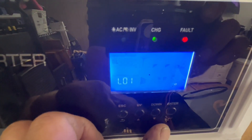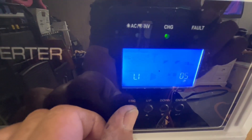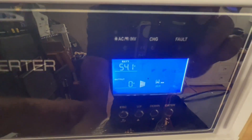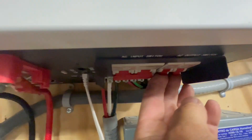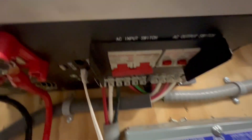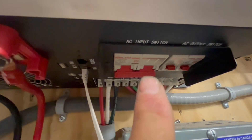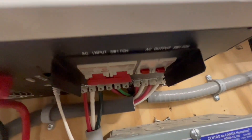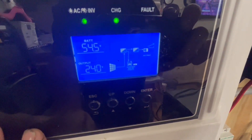It hits fault — give it a second, and it's gone. Now if we hit the Escape button over here, we get back to the main screen. Now we can turn our inverter on — there we go. There's our 240 volts. We turn these switches on right here, that gives power to my unit. That is the AC output, and you have the AC input over here. There are double breakers on those — flip these two small breakers over here and you are up and running. If for some reason you have an error on there, go back and start over.